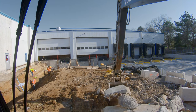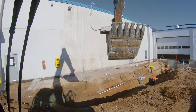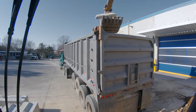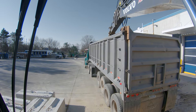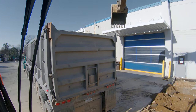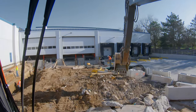You also want to make sure your truck doesn't have any sort of plastic liner in it. A lot of times drivers will put a liner inside the box to help dirt from sticking to the bottom. If they've got a plastic liner, you're going to absolutely destroy it. So it's important to confirm with your truck driver that he is able to carry concrete before you just go piling them high.